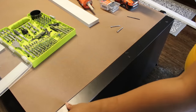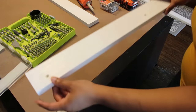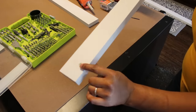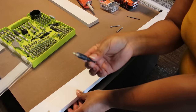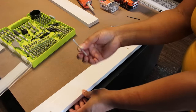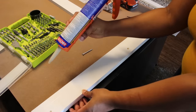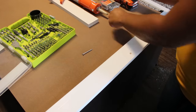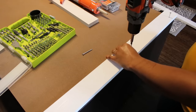Along with the paneling to give the back a nice clean finish, I added some primed wood boards — these are two by threes. I created pilot holes and did a countersink hole before attaching them with screws and the same construction adhesive. I'll show you in just a second a close-up on how I did the countersink holes.